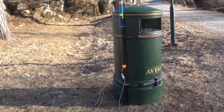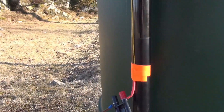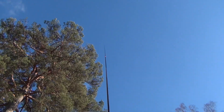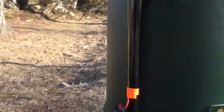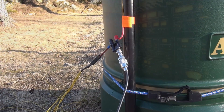Antenna number two on my recommendation for new hams is the quarter-wave vertical. Like the dipole, it's a monoband antenna. You have a quarter-wave vertical element with a radial net beneath it. It's easy to build — I made a video on it called 'The Easiest Portable Antenna Ever' — and it's a great performer. A ground-mounted vertical has a low radiation angle, which makes it ideal for DX contacts, especially on the higher bands where the lengths are shorter. So make yourself a 20-meter quarter-wave vertical antenna and catch those DX contacts.